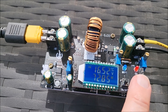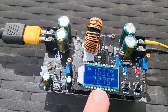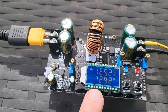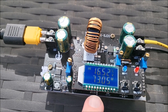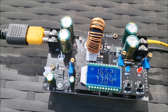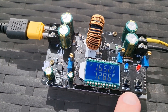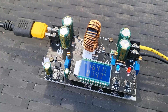This is a software 300 watt limit — if it sees 300 watts on the watt meter it'll shut off the output and say over-power. But you can buy this module without the display, and I can take this display off and it will continue to work. So you could potentially defeat that 300 watt limit simply by not having the microcontroller and display on here, giving it no means by which to switch off the output.